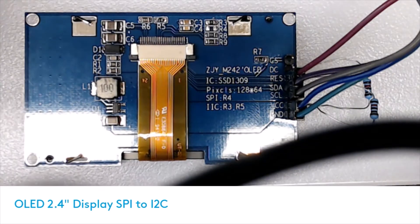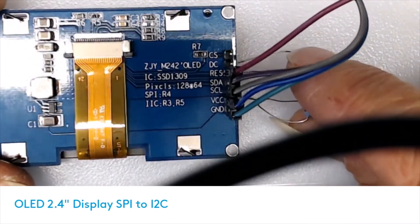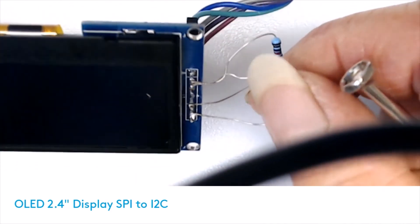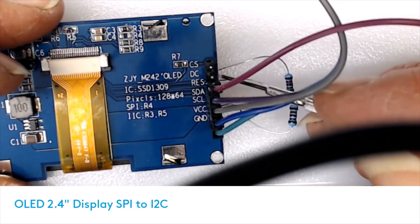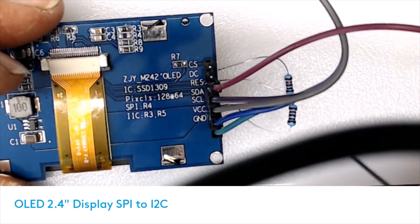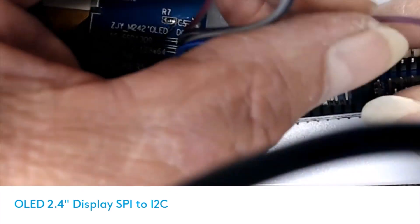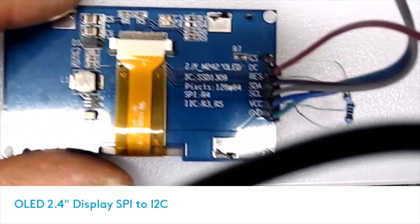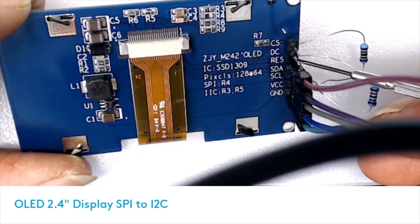On the end here I've got two 10k pull-up resistors because I haven't put this on a board yet. They both go to VCC. One of these pull-up resistors pulls up DC and the other pulls up RES, which is the reset. You do need to connect that reset pin - this is the purple wire - to the reset pin of the Arduino. So when the Arduino resets, so does the display.